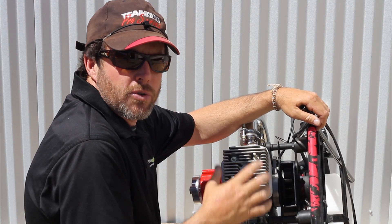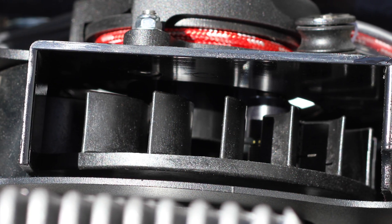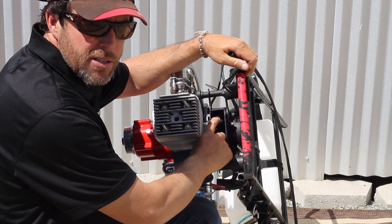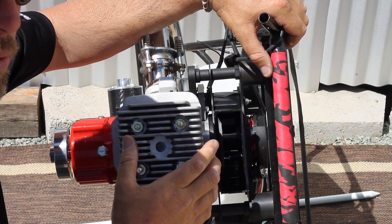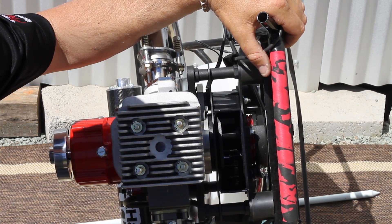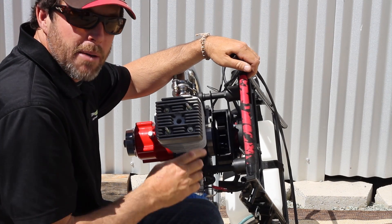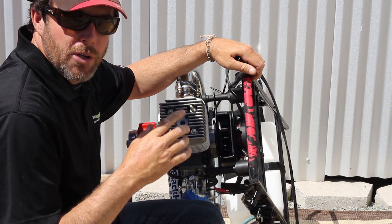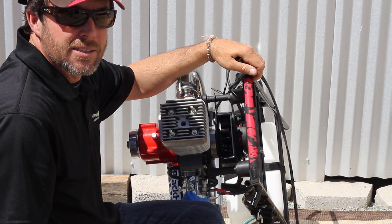We're going to inspect the fan. Look inside the fan cavity now that you have the outer cowling off — check if the shroud that covers the fan is cracked. Keeping your engine cool is the most important thing in keeping a two-stroke motor alive and flying for years to come. While you have her apart, inspect everything you possibly can. A clean engine is an engine that doesn't give you any problems — you'll notice anything that might be becoming a problem. It's better to notice it on the ground than in the air.